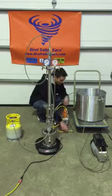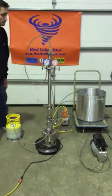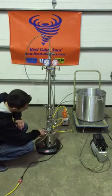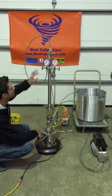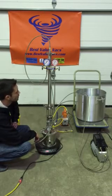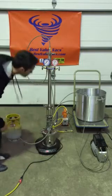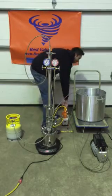We've got the vacuum pump plugged in and we're going to fire that up. What we're looking to do is pull the system down into a vacuum. It doesn't require a very long vacuuming process — usually let it run no more than 5 to 10 minutes. The compound gauge is indicating we're at minus 30 up here, about minus 29.9. These gauges aren't super accurate but you'll get within about 2.5%. I can hear the audible noise in the pump change, then I'll close off the valve on the vacuum cap and turn off the pump.